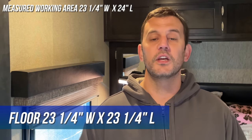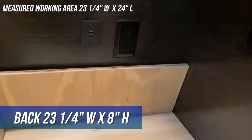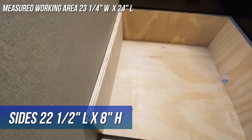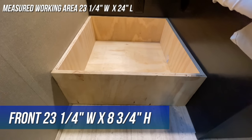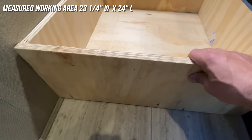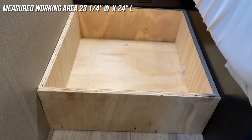We're going to take three-quarters of an inch off the front because that's the thickness of the wood we're using for the front fascia. The back piece is going to rest on the floor of the foot locker, 23 and a quarter inches wide, and we're only going eight inches up, which leaves a one inch gap between the outlet and the top piece. The side pieces are the same height as the back piece — eight inches — and 22 and a half inches long, which is three-quarters of an inch shorter because they rest in front of the back piece. The front piece is 23 and a quarter inches wide and eight and three-quarter inches tall because it goes all the way to the floor of the RV — it's a much cleaner look when staining.